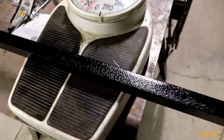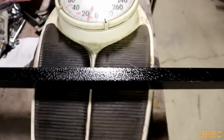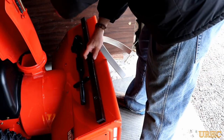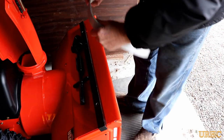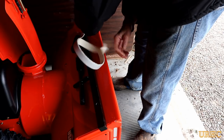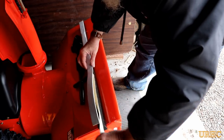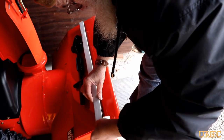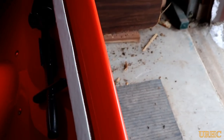I got a couple coats of spray paint on them and set them by the wood stove to dry. They came out to about 10 and a half pounds a piece — I've read the Ariens ones are a little over 10 pounds each, so I made two that are equivalent to the Ariens weights. I checked that everything was going to fit, then I had a piece of foam rubber used for mounting a camper shell on a truck — inch-and-a-quarter wide by 3/16 thick — and figured I'd put some of that on just so I wouldn't put any marks on the snowblower.